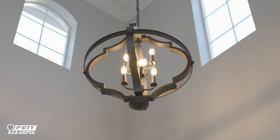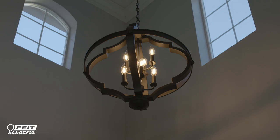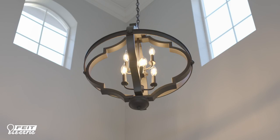If you experience any bulbs flickering with your dimmer, first tighten loose bulbs and ensure all LED bulbs are rated dimmable. If flickering continues, it may be caused by surges and spikes in your electricity. Limiting how far the lights can dim may help troubleshoot flickering.